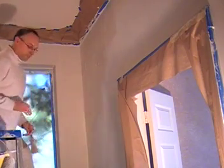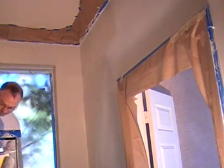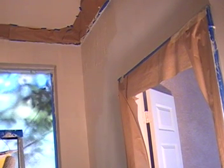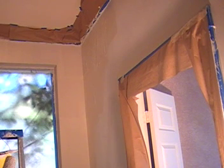Nice. All right. And we just worked the corner area, and we will now work our way down and then across. This is full finish with tissue. We're using a base coat of an antique white with a metallic, and then a light brown as a top coat, just brushing it over.